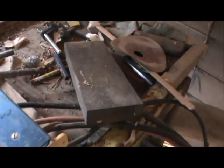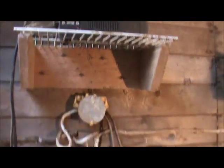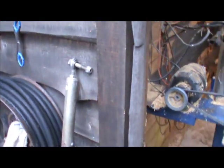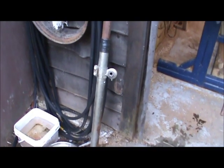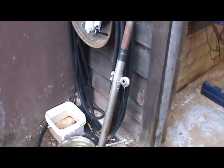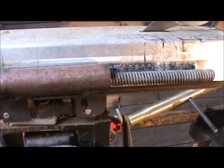For my trolley platform, the cables run about 20 feet long back to the box along the back and up to the little unit that actually moves the saw. This is off a satellite dish — one of those old big ones about eight feet across. They've got a great worm gear in them and they seem to do the job really well. I just took all the junk off the outside and it's worked really well. I welded a piece of that onto the actual saw so it moves back and forward.